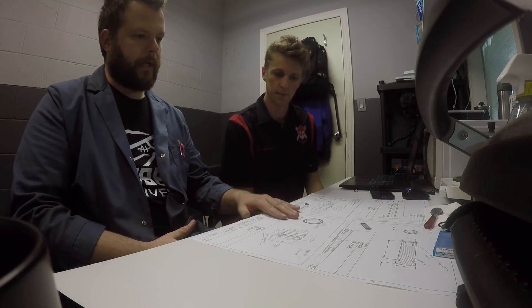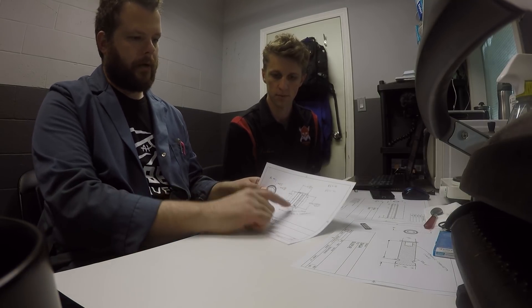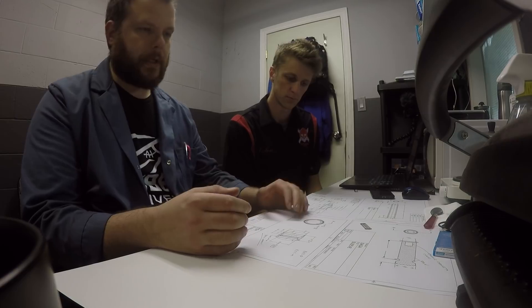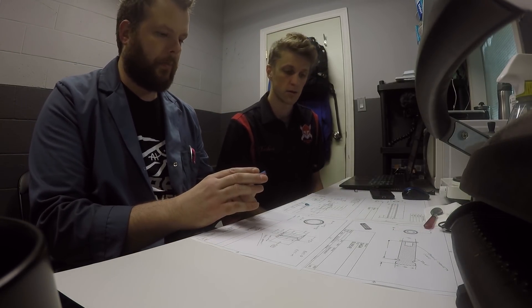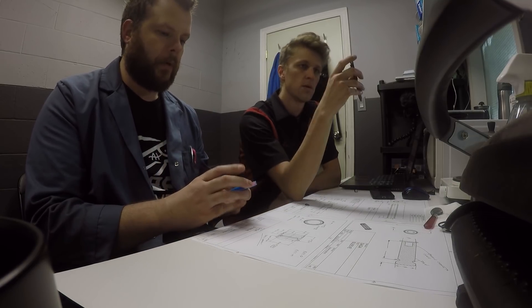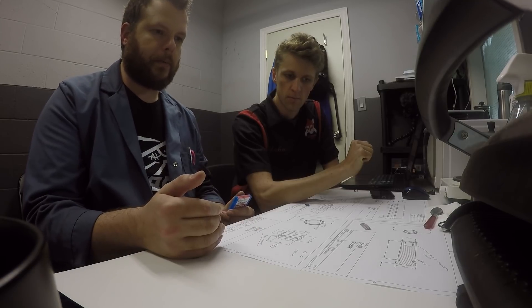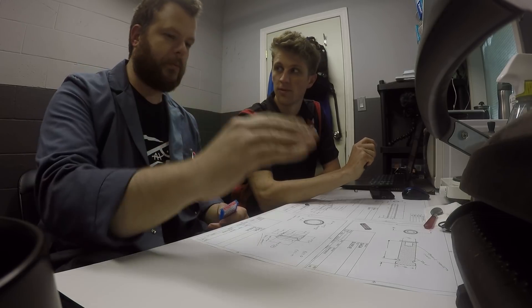So right now we'll find our risks and try to mitigate them. When we find errors in certain areas like tool chipping, we're going to put things like that as a key dimension, key characteristic. We're also going to look at our tooling and see what alternates we can use, and try to create the most stable process possible so that we can make repeatable parts to tolerance consistently, predict our tool wear, and predict what issues we might potentially have.